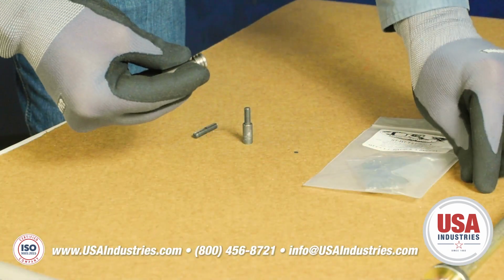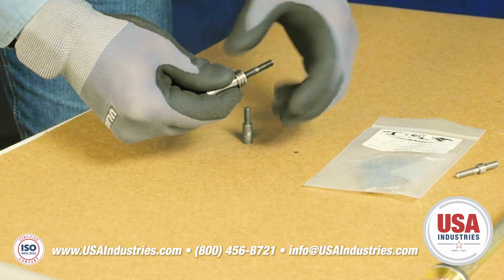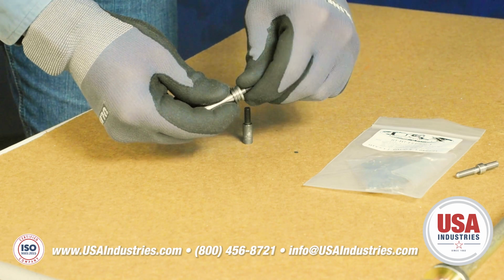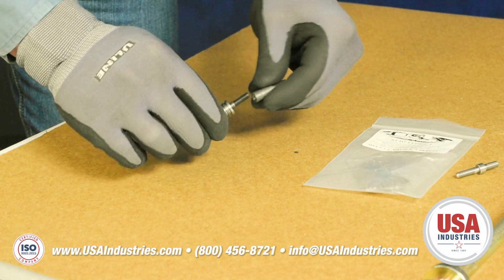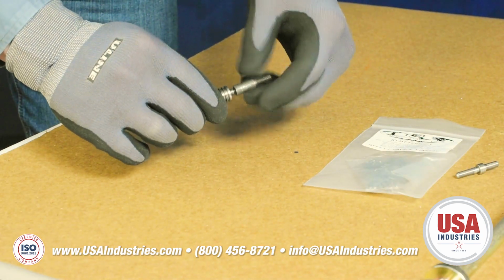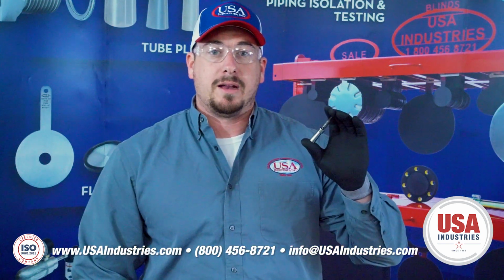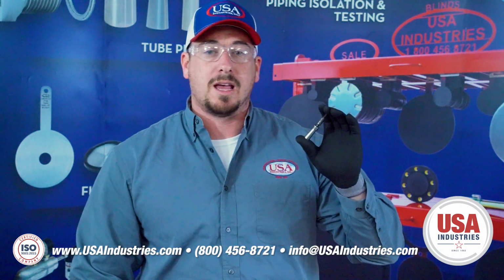After you've removed the breakaway, you want to then add your reverse threaded stud. Once the stud is securely fastened into the ID of the pin, you want to then add your coupling. So now that the stud and coupling is added to the plug, it is now ready to be added to the far-end pull rod assembly and install the Snap-it plug.